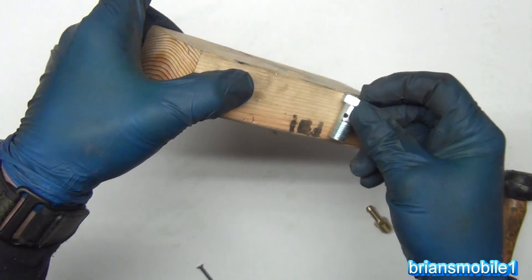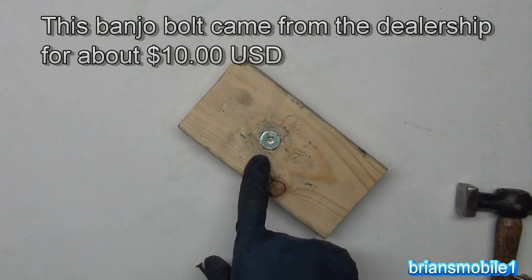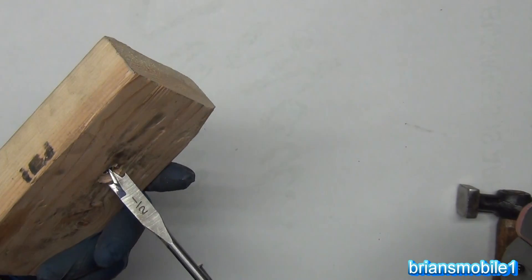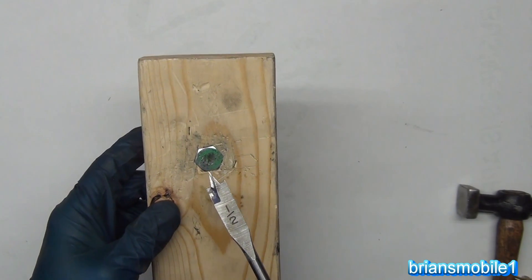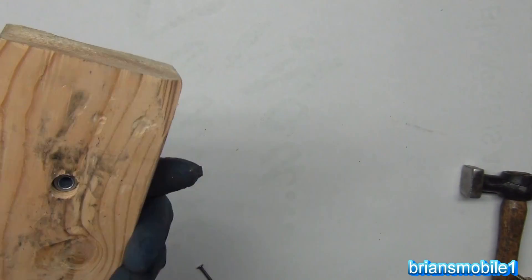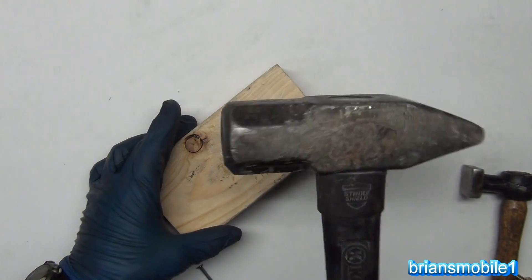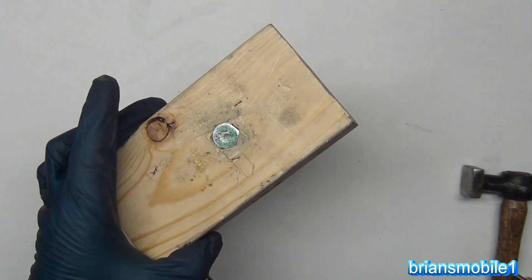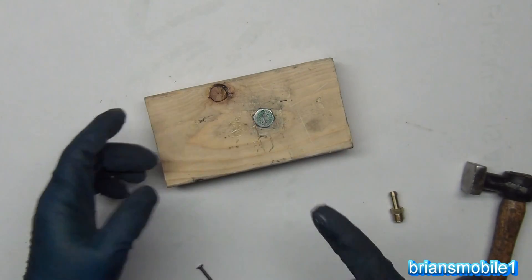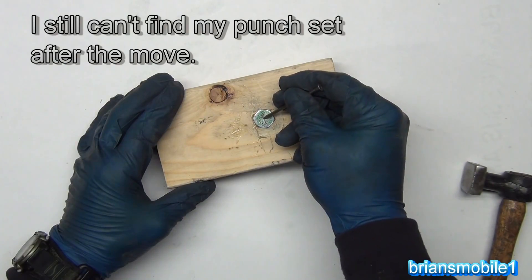A 2x4 is plenty deep enough to accommodate the thing, and who doesn't have a 2x4 block sitting around, right? I've got my banjo bolt put into the wood block. I basically took a paddle bit and drilled a half-inch hole, because the threads on this are M12 by 1.5 — so 13 millimeter, half inch — that's enough to get all the stuff through. What I do is drill a hole, stick the bolt in, and then take a big flat hammer that's not going to damage the back side of it, and just pound it into the wood. The wood's soft enough it'll take it, but hard enough that it'll hold it when you're drilling, as long as you're not too aggressive. Got a little bit of oil on there. We're gonna drill the first hole — but before we do that, take a nail and get it between all the points right there.